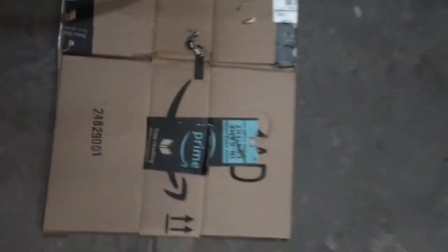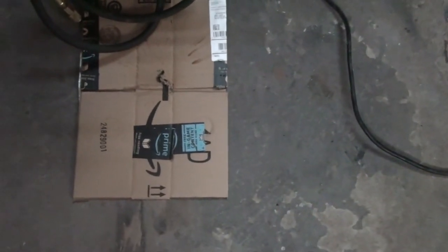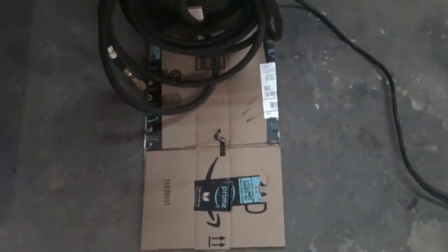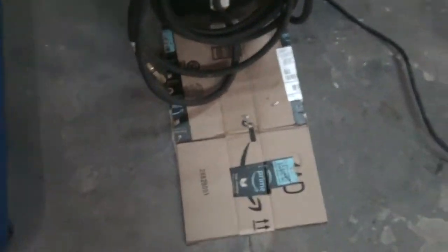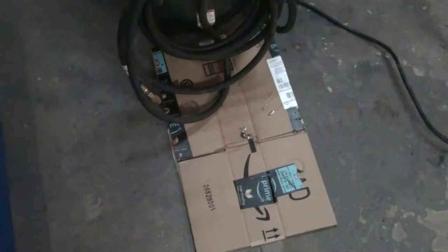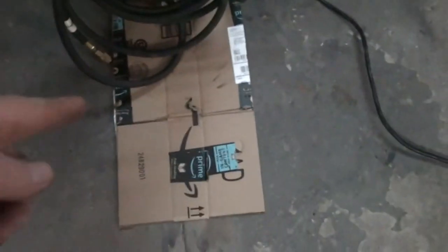It's going to be hard to see, but it's about the size of a quarter maybe. That's all that came out after about a month of pretty good use, kicking on several times over the weekends — so that's not too bad. It takes on about as much water as any other air compressor. If you're going to do any painting, you definitely want a water filter on the end of your hose, which is something I didn't get and I'm going to rectify soon. What I usually do is take the valve out and just let it sit overnight so all the moisture is out of it. So far so good — no rust, no rust in the water.